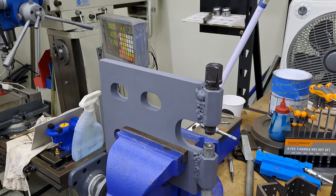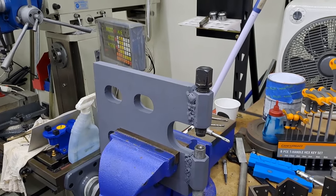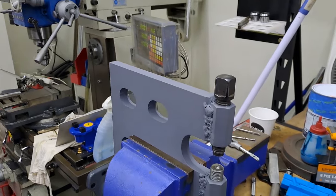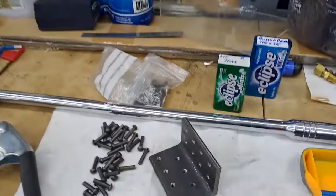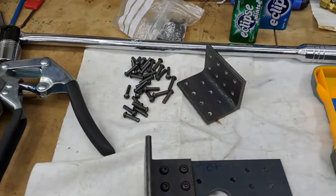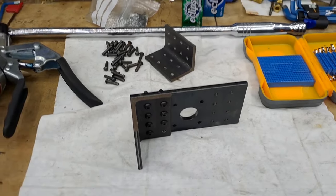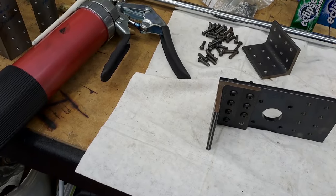Nice and easy this thing, didn't take long to make, but it does a damn good job — or it did on the tender anyway. I haven't used it since then, but nothing's moved by the look of things. The welding's still crappy — it was crappy back then and it's crappy now. Right, so I'll get you onto the tripod and get you in as close and as low as I can so you can actually see the rivet press working. I'm going to be using my 24-inch breaker bar on that big bolt there, and hopefully we'll be able to see this thing compressing the iron rivets. I've got a few bags full of them — these are 3/16 by 3/4 rivets, which is what the drawing calls for.